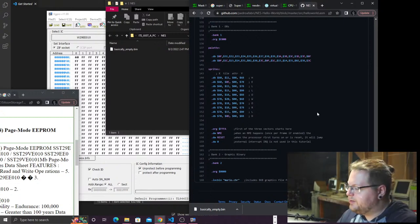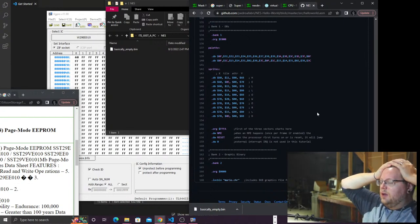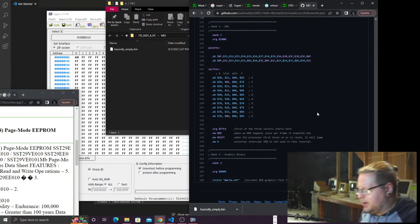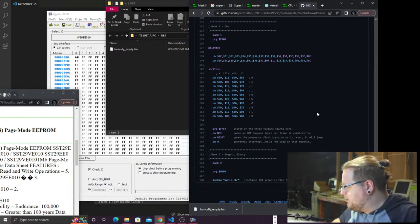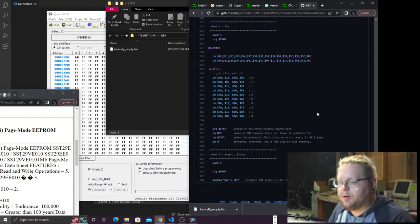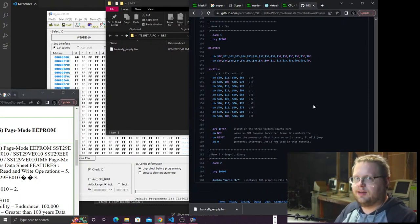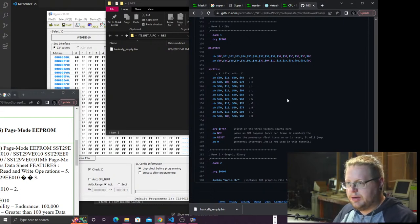It's not that there's default handling per se, but the only comparable console programming that I've done so far is for the Genesis. And the Genesis does have a minimal onboard boot ROM, so it's not a crazy thought, because that boot ROM actually does check some stuff in the header. But it would appear the NES does not.